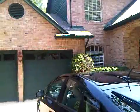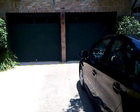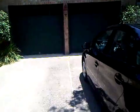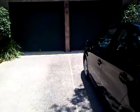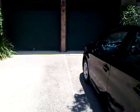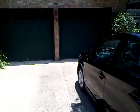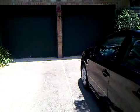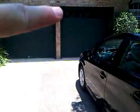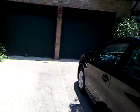Garage door frames, they're coming all the way down into contact and sealed to the pavement, so not doing anything in terms of rot, not helping any problems there as far as that garage door wrap coming all the way down to the cement and sealed to the cement. It's also pulling away from the center brick column here. The wood trim is actually pulling away. The caulking has failed, so we would address that as well.